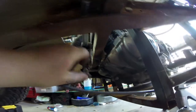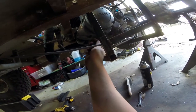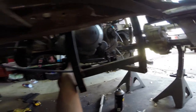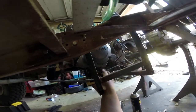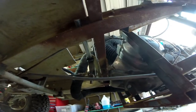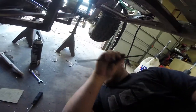We've got our rod in place where we wanted it. We've got the two-and-a-half inch extension in. This is our 12-inch extension rod, and you can imagine it running from pivot to pivot, center to center — totally perpendicular. We're going to move this so it lines up, it clears the bottom of the case, and this will give us plenty of range. Then we're going to figure out a way to fixate this in place and put the lever at the right angle so we can move all the way forward and all the way back without hitting the seat when upshifting or downshifting. Next we've got to weld our little extension.